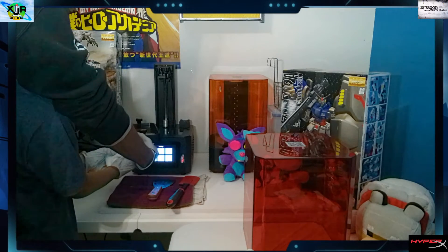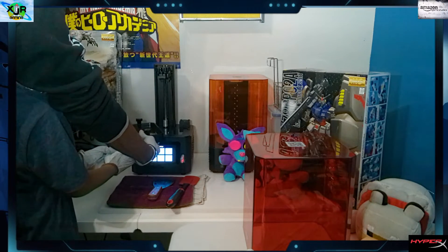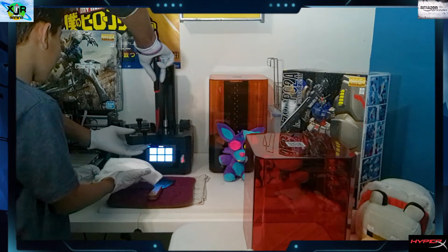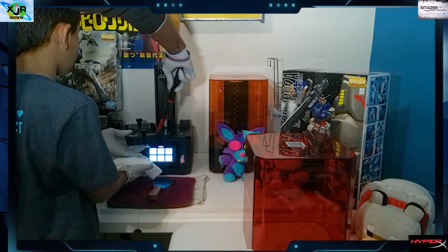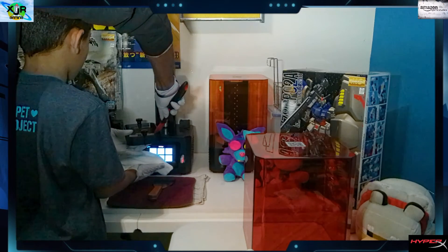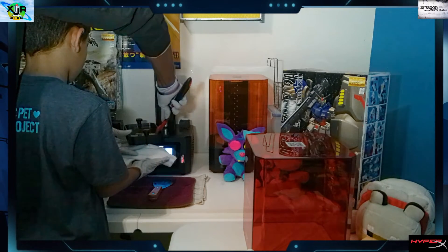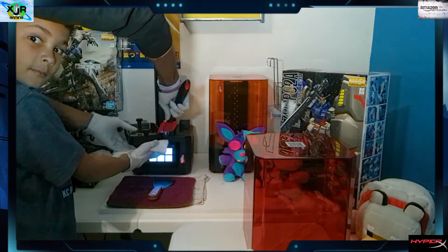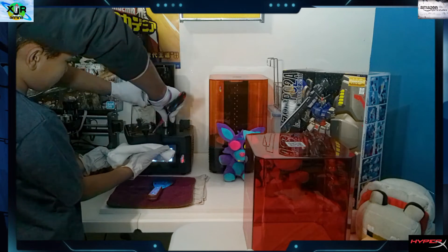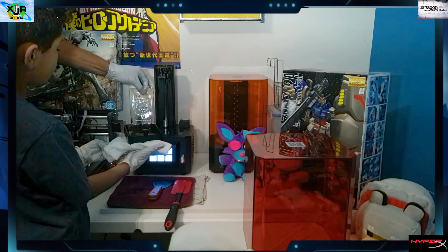We get a soft microfiber towel and gently press around the edge of the bed to loosen up the material that the printer created. Then get our clean spatula and just kind of wiggle it around in there. We're lifting up what we call the junk resin left in the bottom of the bed. Just work your way around the edges.